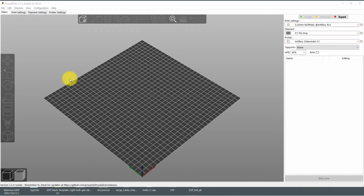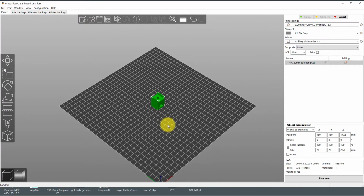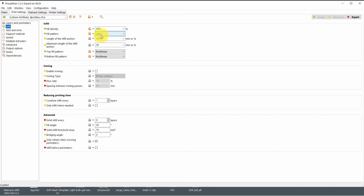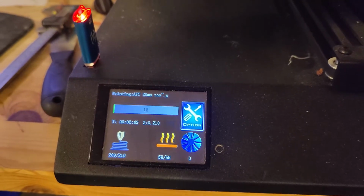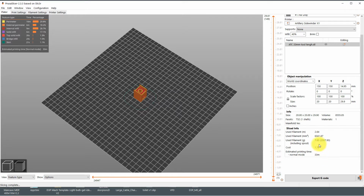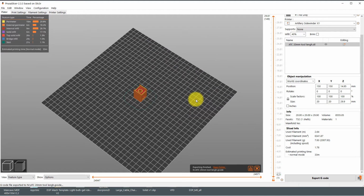So I loaded the Prusa Slicer and imported my STL file. First I took the tower and printed it with 40% infill, 205 degrees for my filament, which is individual. It took 28 minutes to print that one, and then I printed the tool stop, and that took 11 minutes, and I also had 40% infill there. If you want to download this, you can get them through Thingiverse, and the link is below in the description.